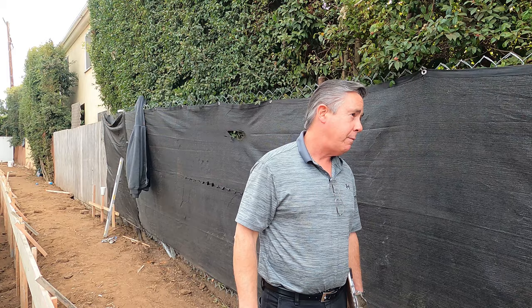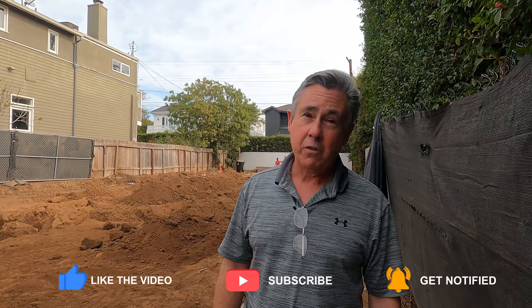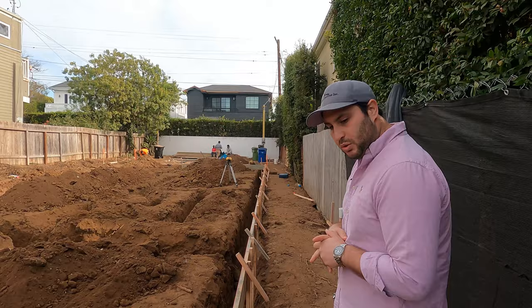My name is Juan Videl. I'm here to check the footing excavations to make sure the depth and per-plans proof foundation plans are in competent materials, so once they build the footings and build the house, everything's good and there won't be any settlement issues. I'm here to make sure you're not on old fill and that the native soils are competent — not poor soils prone to hydro-consolidation, which can cause settlements. There's no fill here, the footings look good, there's no porosity in the soils — so the likelihood of the house having problems is very little.